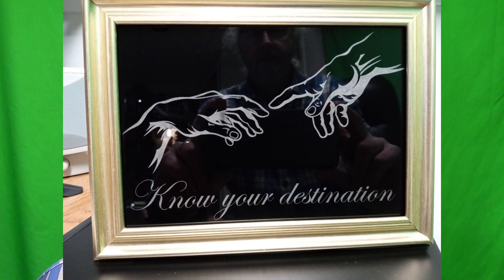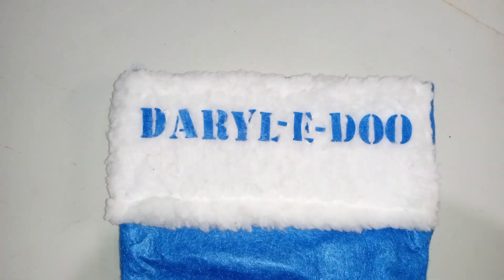It is kind of cool to see the movement of the gantry when it's up at that speed. The performance of the laser itself has been pretty good. The focusing is relatively easy to do — it locks in nice and tight so the laser emitter doesn't seem to slide up and down once you've locked it in place. The cutting and etching has been pretty good. I would always like it to be more powerful or have the laser dot more focused, but it is what it is and it does a great job. All the material burned well: glass etching, fabric cutting.